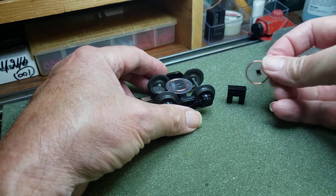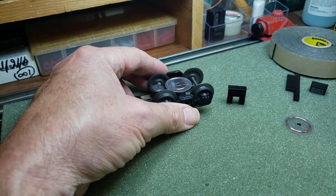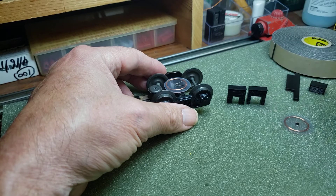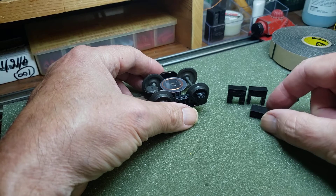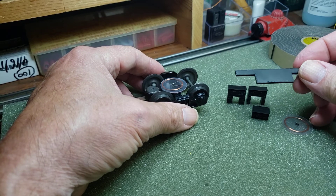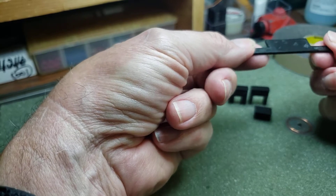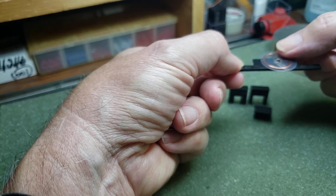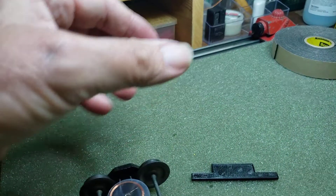Some of the other detector mounts I've made: here's another U-shaped one that needed a little more clearance around the rivet, so I made it with wider feet. I made a simple little square box which can be used on some cars just to get the tag mounted with no clearance problems. I also made a more sophisticated shape that I've used on the bottom of some engines, where I could use Walther's Goo to glue the mount on the edges and then use double-sided sticky tape to mount the tag on top.